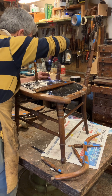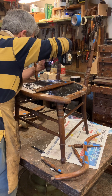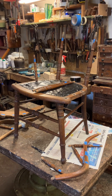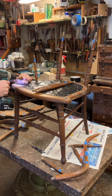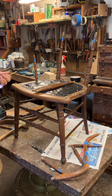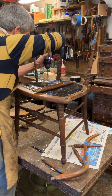To do that I'm going to use a drill with a little point on it. Try and get the hole angled exactly the way the spindle is angled, because otherwise the spindle is going to go in the wrong direction. I would normally put this in the vice but for the video I'll do it by hand. I've made sure I've got a drill that's the right size - I tested it on a piece of pine first rather than drilling the wrong size, because that's really frustrating. So I'm just going to drill the right size now for the dowels.